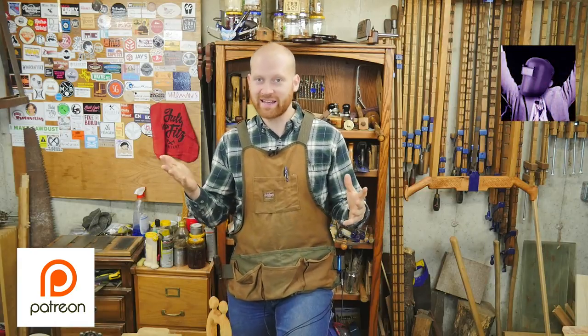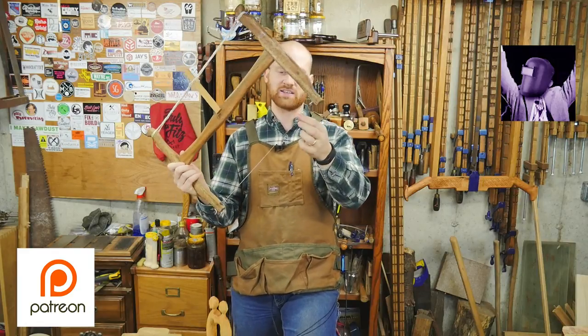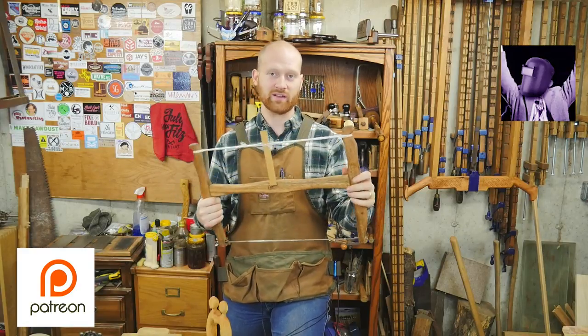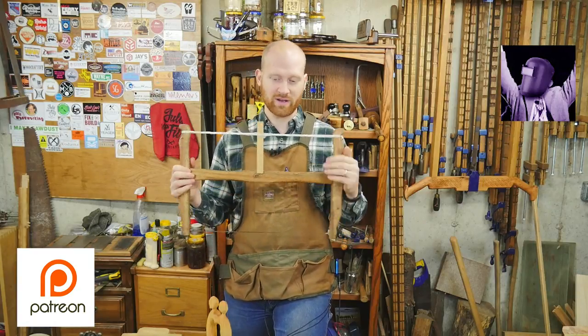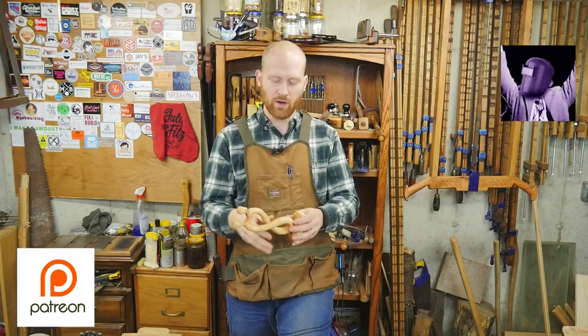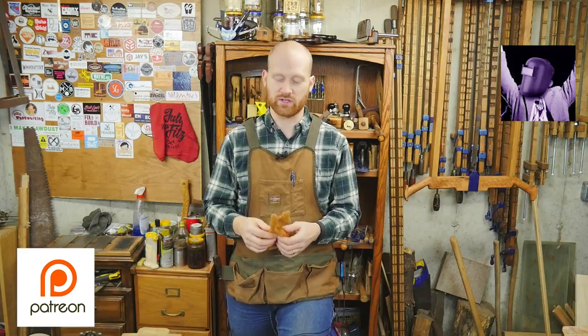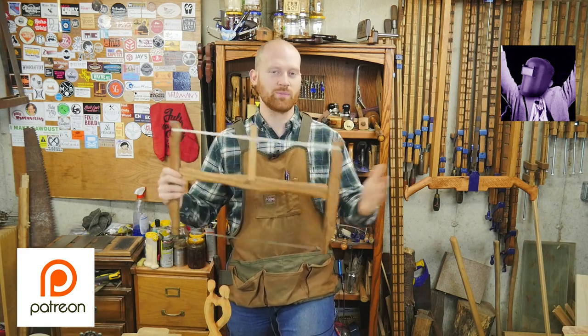The Patreon question of the week comes from Doc Darkness, and he asks: how do you take out large chunks of wood from a large piece of wood without a bandsaw? In the hand tool world, a bandsaw is called a turning saw, and I actually have a bandsaw blade in it. I did a video a while ago on making this, but this can do anything a bandsaw will do — a little bit slower, but a lot more fun to use. For more delicate things, there are other ways. On things like this, I actually just used a relief cut — I put in relief cuts and then used a chisel to take out the waste. You can remove a lot of material very quickly with a chisel. You don't get to save the material, whereas with the turning saw you get large chunks, just like a bandsaw.